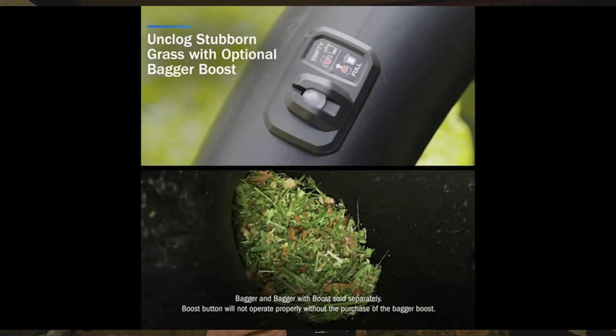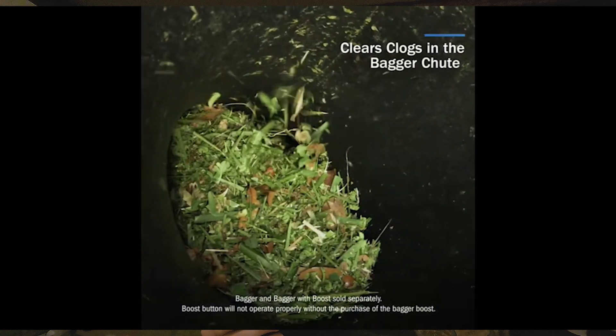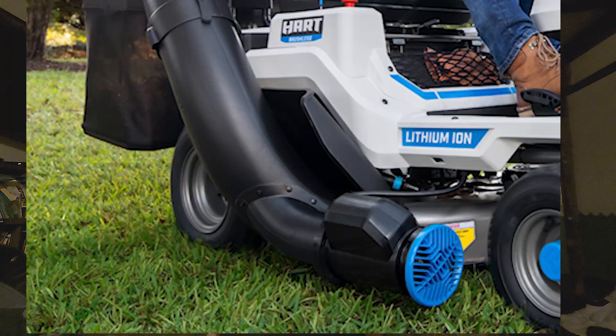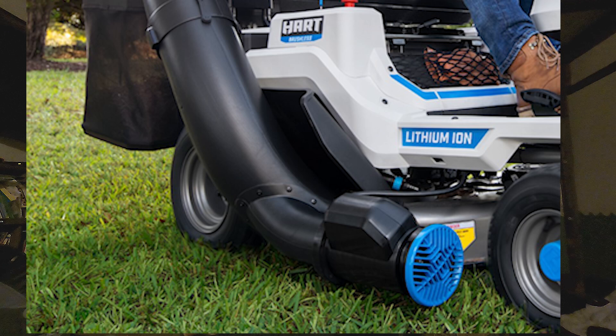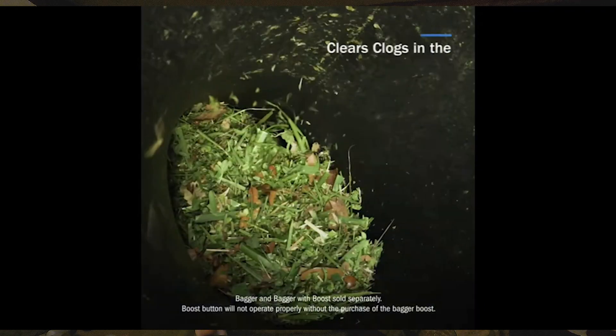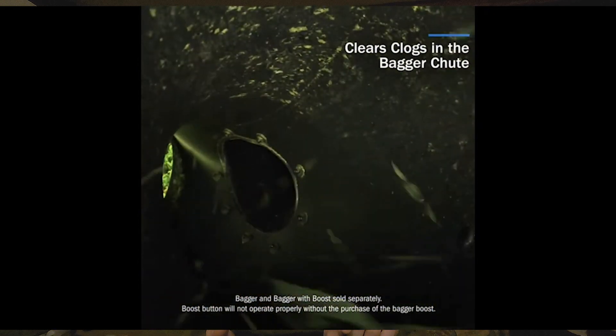Something that I want to highlight that just blows my mind — I can't believe they have it, it is amazing. We're going to zoom in and what do we see? This is a blower. This is actually a 700 CFM blower that they have integrated within the chute of the bagger. So whenever it gets clogged — and they always get clogged — you just hit the button, turn that on, and it blows it out. On the Ryobi ones, they have something called chute clear, and it just spins the blades a little bit faster. But this is an external blower, and if you look at commercial mowers, they have something like this where it chops it, dices it, pushes it, and gives it that extra power to get through. This is mimicking that, doing basically the same thing. So you're going to be able to clear that chute, especially with 700 CFM — that is very, very impressive.